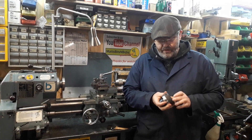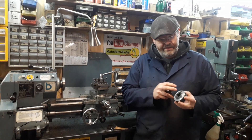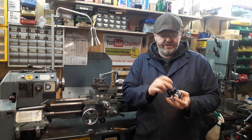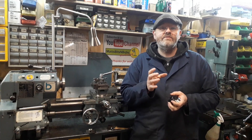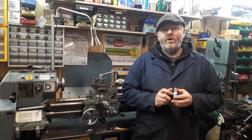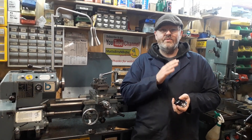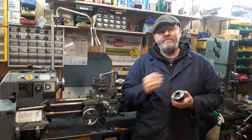Basically this comes in two parts - a bit threaded to go on the lathe with the register, which gives us the actual chuck block itself, registering the three holes to bolt it down. Obviously your collets go in. When I got the Boxford there was a new back plate for a little four-jaw chuck, never been fitted, still in the packaging. So I'm going to use that - I'll make a register to go onto here, drill it, tap it, and then we can bolt this on. I'm also going to leave it so that in the future if I need to, I can put a new register on and use it for a chuck. The idea is that once the registers are machined, I should be able to swap them between the Myford and the Boxford.